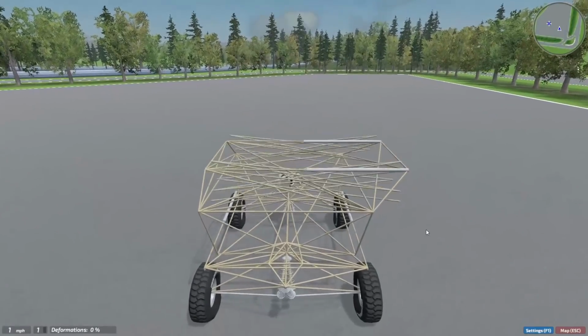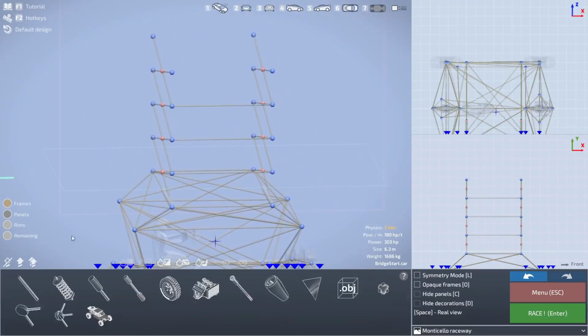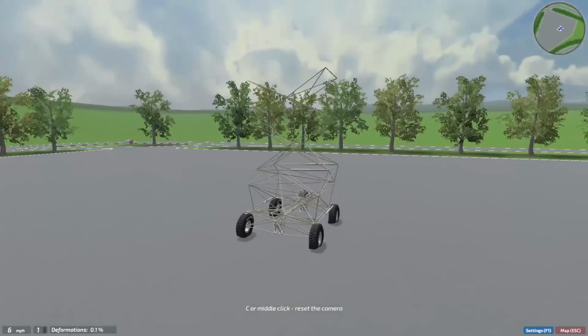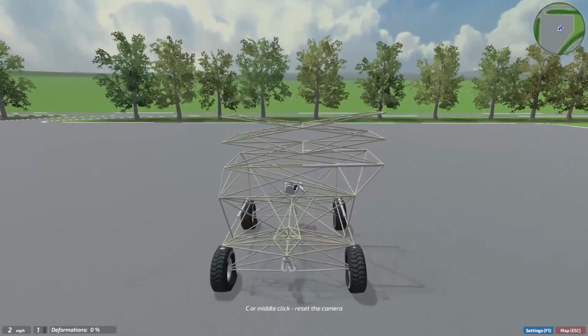And now if I run it, it works the same way as the first one, you can see. But the idea is if I connect them together like this, it should allow these two mechanisms to expand and contract while still staying rigid in the X and Y directions. But after doing that, now if I give it another test, you can see how the entire mechanism just expands out and I got a bunch of these stacked X's.